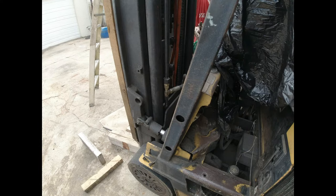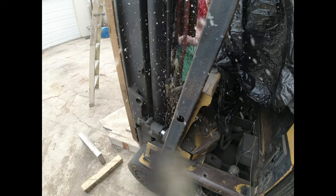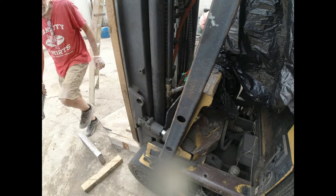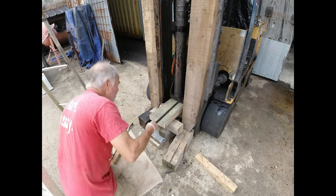What happened was what I expected - the fluid went everywhere. But what I didn't notice, because the fluid was going everywhere, was that the hose dropped about 12 inches straight down because it was actually holding up the bottom part of the inner mast. That's what made it hard to put back together later on - I didn't realize what had happened. Anyway, that did the trick: the cylinder no longer had pressure on it, so I was able to move forward.